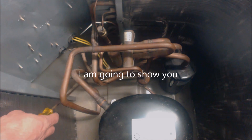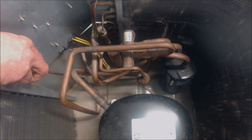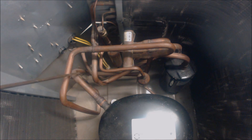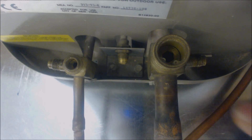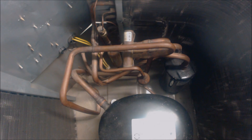There's also one more line in the middle — in between the large vapor line right here and the small three-eighths liquid line. This middle line is actually pure suction all the time because it's connected to this line here, which is always pure suction, low pressure, low temperature vapor. It usually has a service valve on the outside of the outdoor heat pump right in the middle. So you have your vapor line, your pure suction line, and your liquid line, each connected to their respective service valves on the outside of the outdoor unit.